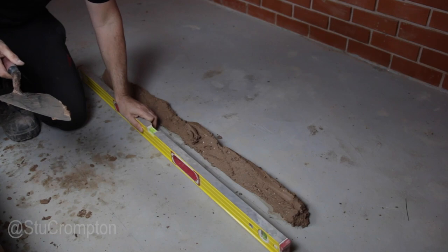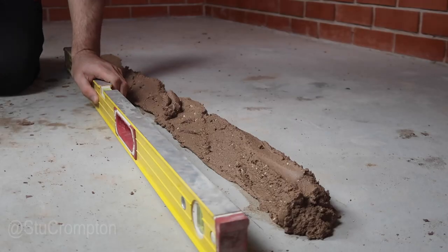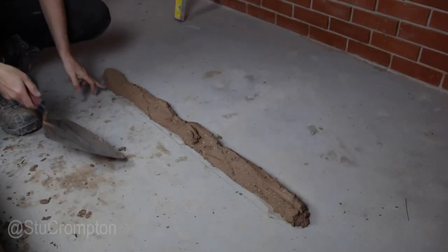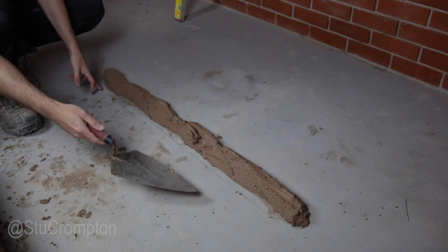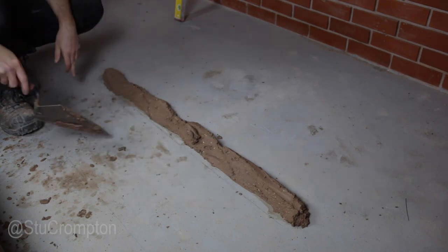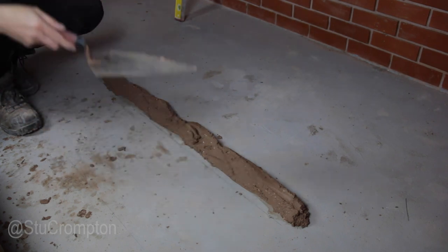One thing I should have checked is if this floor is level — it's not too bad actually, it does run down a little bit that way, but we're okay. Because you've got to think about that: when you're gauging off that floor, you're basically transferring the level of this floor at a different height. So that's how gauging is — transferring the level line up to a different height.